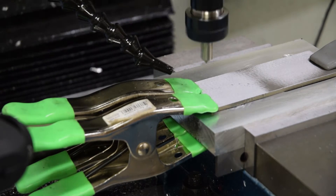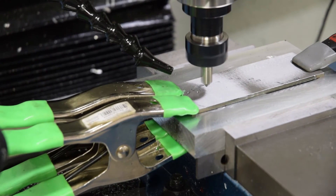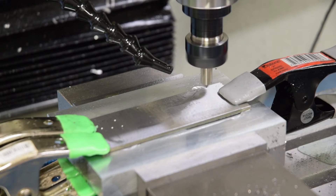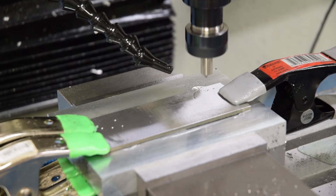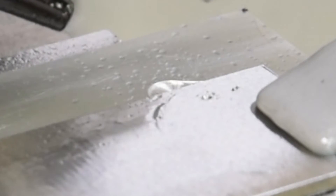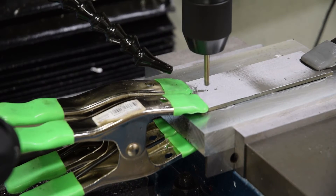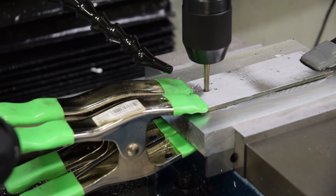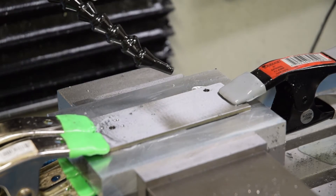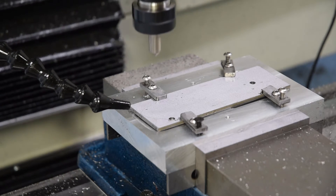In the last video I talked about how I would never use spring clamps to hold the piece down to a fixture again because it's a bad idea — it's probably not safe. Well, you can see I'm a big fat liar because I do it again here, and it bites me right here. The piece just moves — we'll play it one more time so you can see it. It's probably not as big a deal in this application using a spotting drill, but had I been using an end mill, that much movement would dramatically increase the chip load on a single tooth and likely chip or break the end mill, and could have potentially thrown the entire piece.